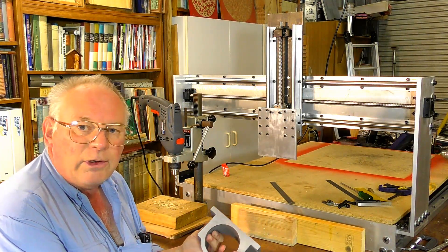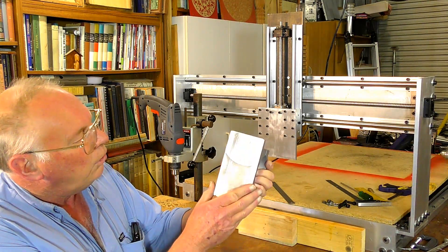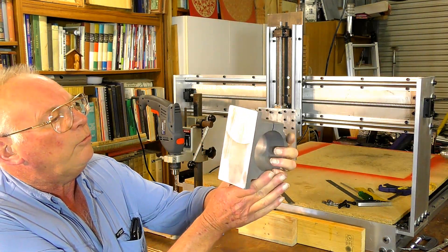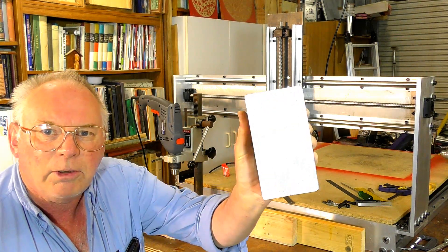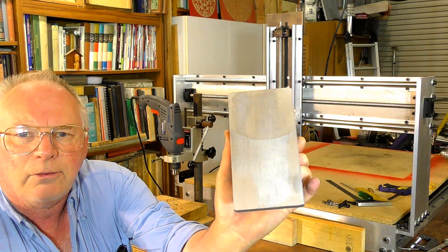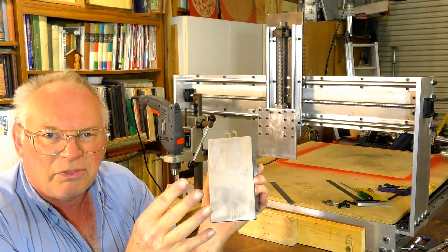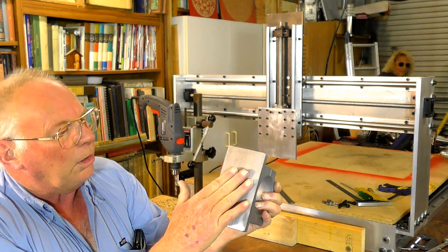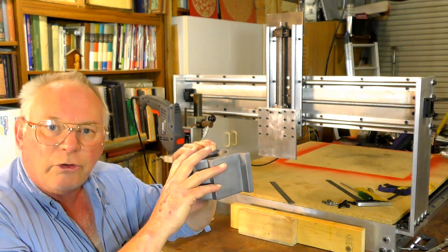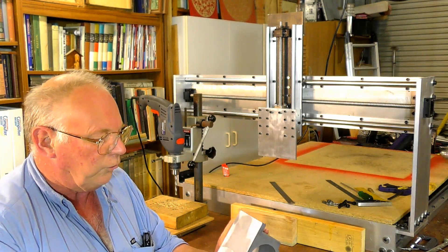This is a very, very good casting - very good quality. However, they have sort of faced it, or should we say half-faced it. I've put a bit of paper on there so you can see there's a machine mark. This is ever so slightly - a couple of thousandths of an inch, maybe about 5 thousandths - stood proud of the rest of it. So that means when it's bolted onto the Z-axis plate, it's going to be cockeyed. So I'm going to surface this.